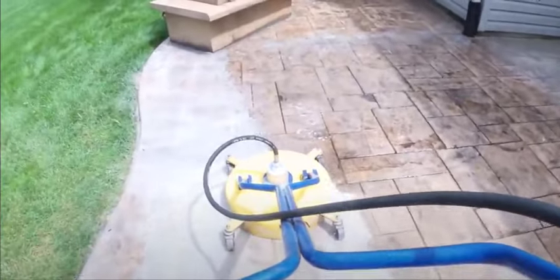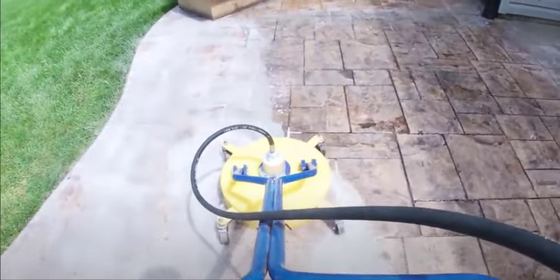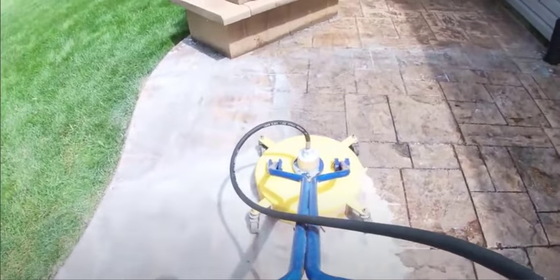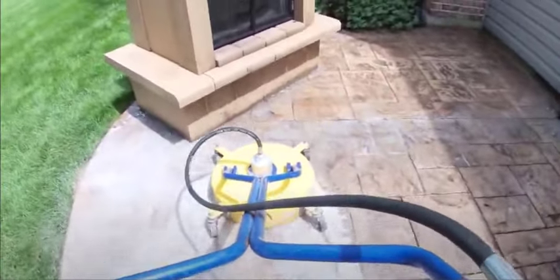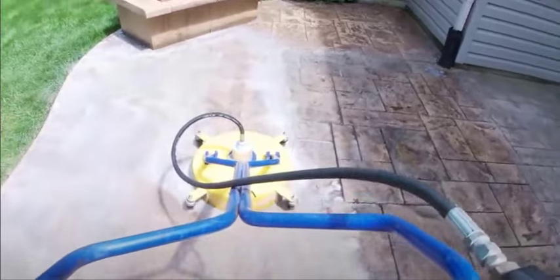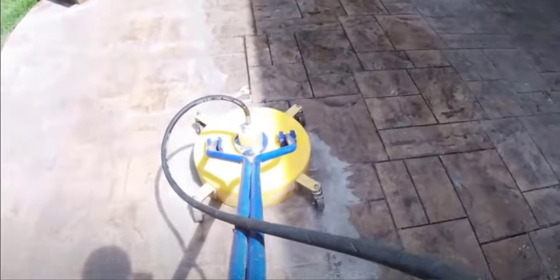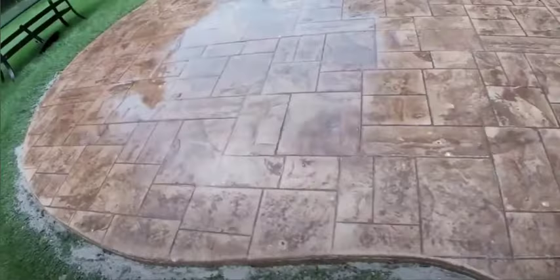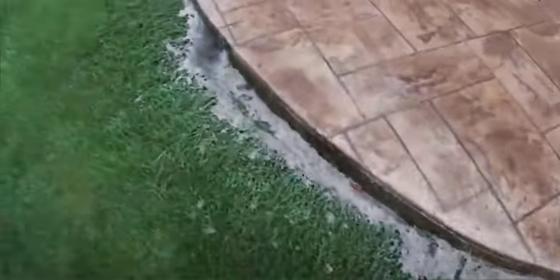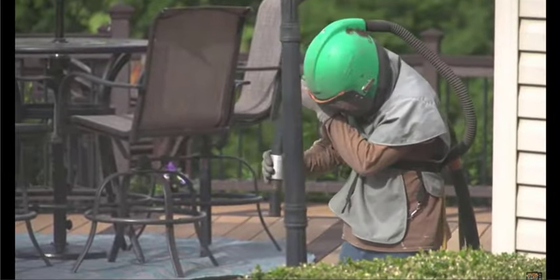You'll see it coming up — see that white foam? Most of that is sealer coming off right there. Do your section, then get your hose out and spray that section down so it doesn't dry back on. Now look at the edges — all that acrylic white concrete sealer has come off, and the concrete is really nice and clean. After it dries out, it's going to look really dull, but you can just seal back over it and it'll look brand new again.